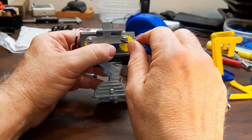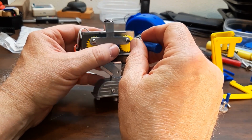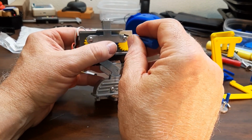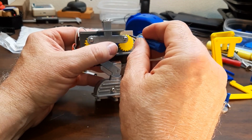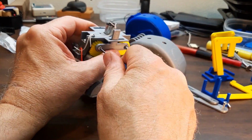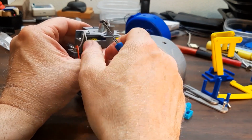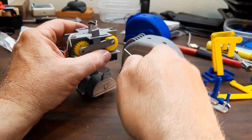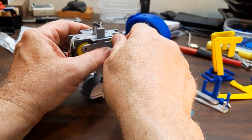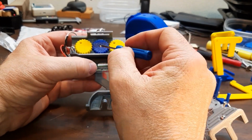When you put these screws, these parts here, the legs, they have to be drilled out to three millimeters, or an eighth inch drill will work also, so that the screw and this rotates on this easily, but it threads into the hole in the gear. You can see the half of it gone now.